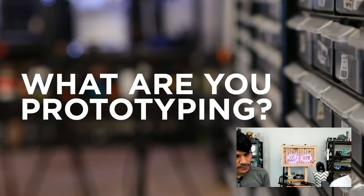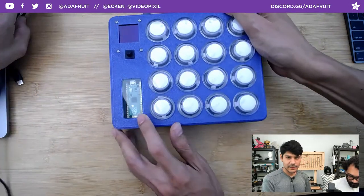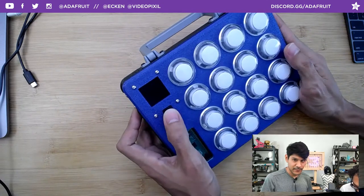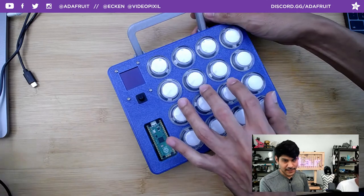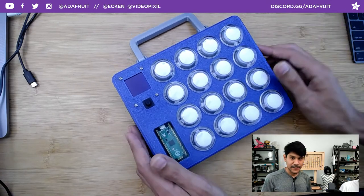All right. So I guess I'll show off the MIDI Fighter project. This is a Raspberry Pi Pico inside here, with 4x4 buttons, 16 buttons. It's going to be running CircuitPython. There's a 5-way navigation switch so that we can change on the fly the MIDI notes for each one of these different buttons. This is a collaboration project with Liz Clark, so she's writing up the code.